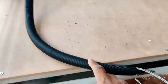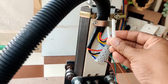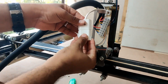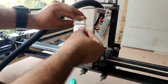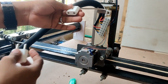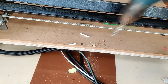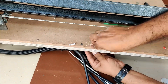I have also inserted the cable for the spindle — this is a 5-ampere cable for 220 volts. I have connected a plug for this: the female side of the plug is connected to the power connection and the male side will go to the spindle. That way, even though the power is connected, the exposed core is not live until it is connected to the spindle — the power is never exposed. The next step is to pull all the cables to one side and I'm going to use metal pieces to hold them in place on the underside of the board, to make sure the connections to the motor controller are easy.